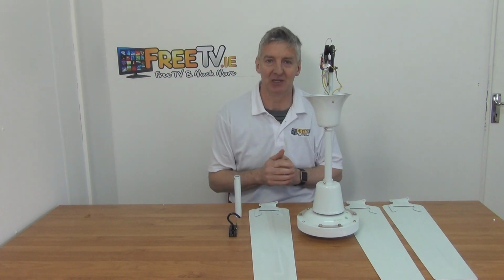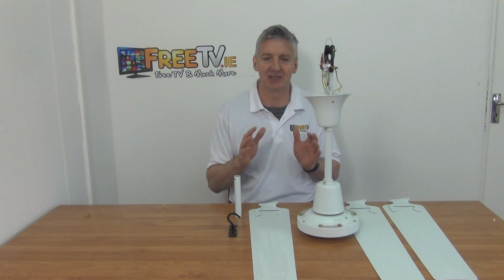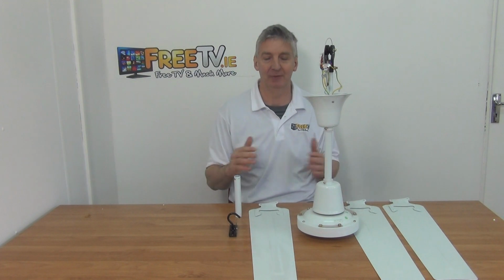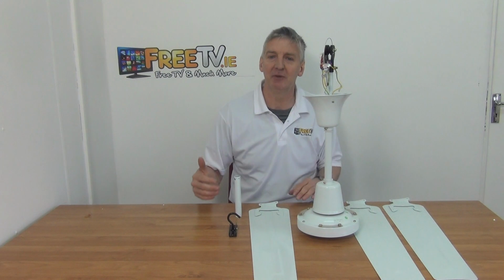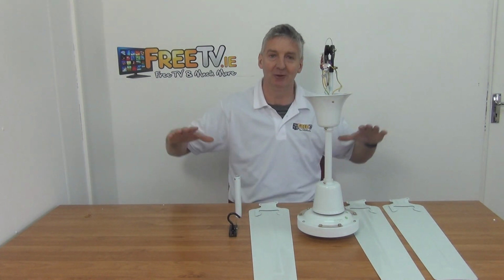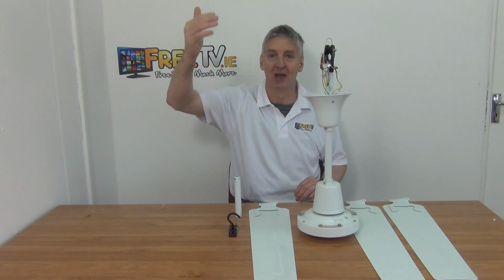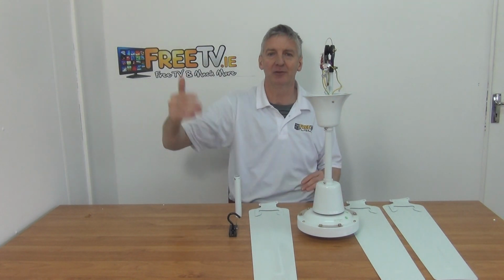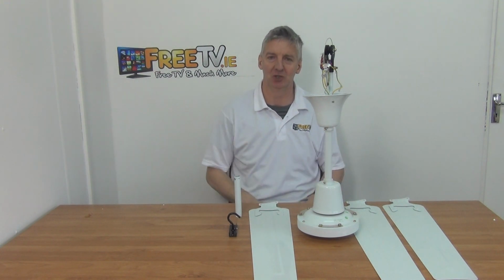Typical applications of it, well, there are two real purposes. The first thing to mention is that the common name for this type of fan would be Casablanca fans. You'd know them from the traditional movies. It's not really giving much of a cooling effect, but it's giving an air motion effect. It's pushing down the air, and you're normally mounting it at about 2.3 meters above the floor height. That's where you want the fan to be: high enough to be safe in terms of not hitting anybody, but low enough to maximize the type of air motion you're looking for.